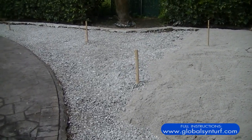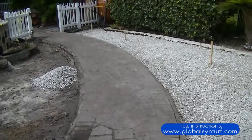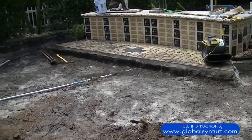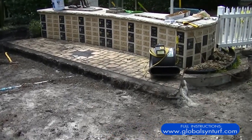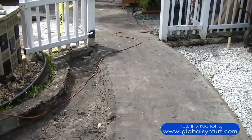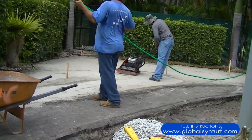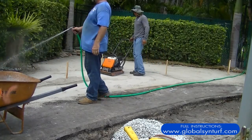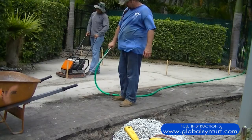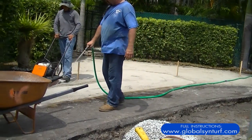During the removal of the fill process, you're going to encounter places in your project that do not have a linear or a hard surface upon which to attach the turf. And so you're going to need to pour a concrete curb to give yourself that option. If you have existing sidewalks, they can be used nicely. Even existing paver walkways that have concrete edging can be used to attach the turf. But where there is nothing, you need to replace that with a concrete curb, probably a 4-inch wide curb, 6 to 8 inches deep, that allows you to tack the turf to the curb.